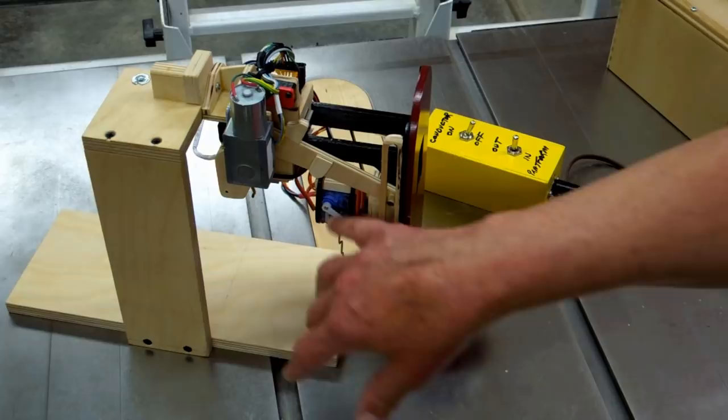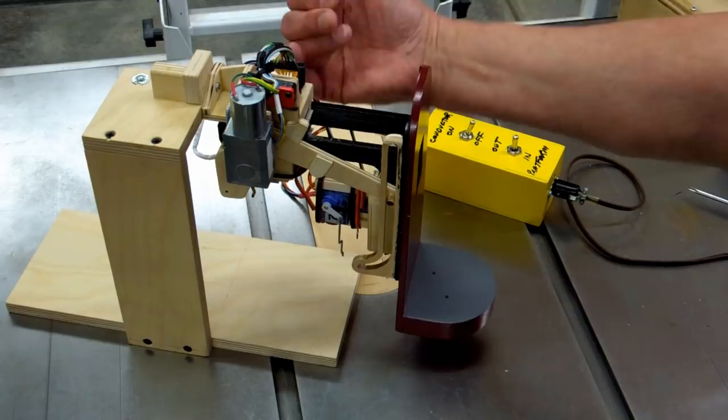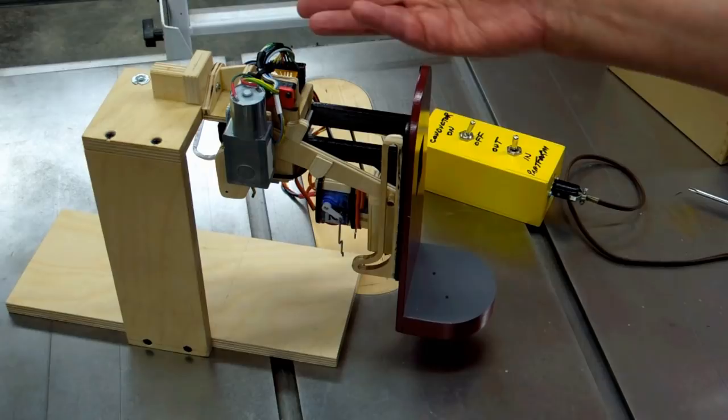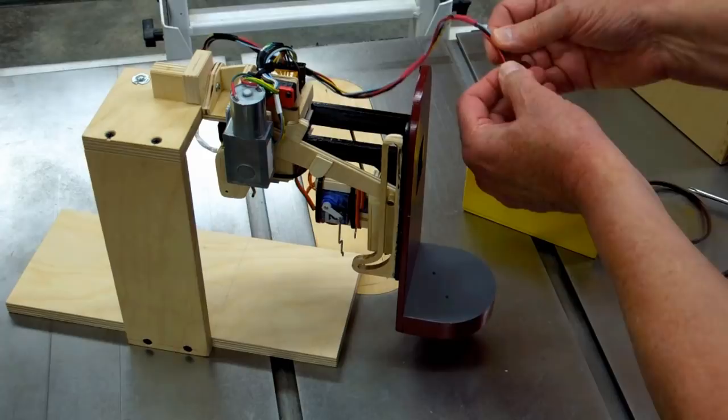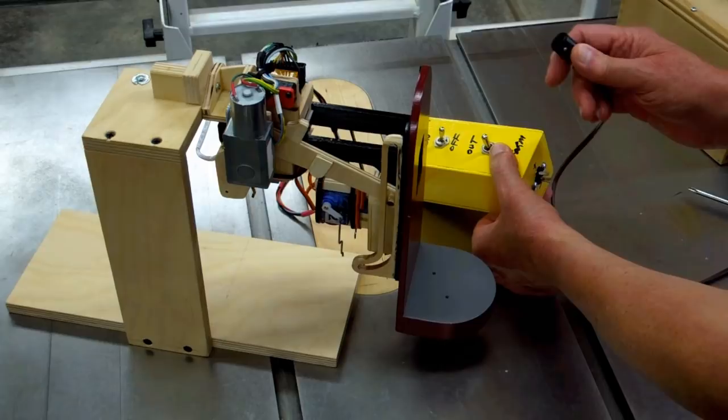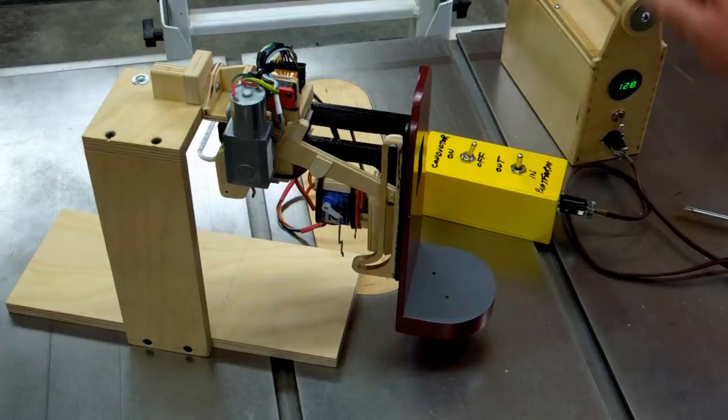This is held onto the linear rail by one machine screw up from the bottom and a wood screw that goes into the pressure box. So it's very convenient to just remove those two fasteners, take this out, and plug it into the organ. It's the same connection that goes into the back of the organ. It has four wires that control the servos and the transport mechanism. I made this little control box, and it gets its power from the same plug that would plug into the back of the organ off of the battery pack.